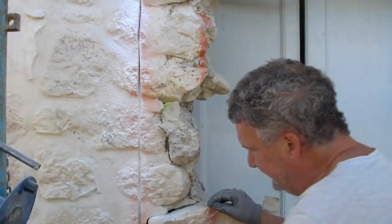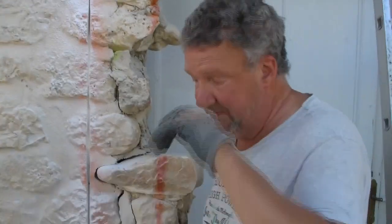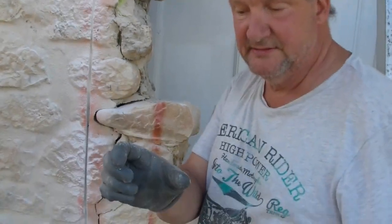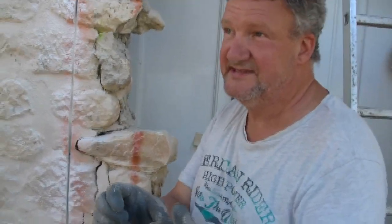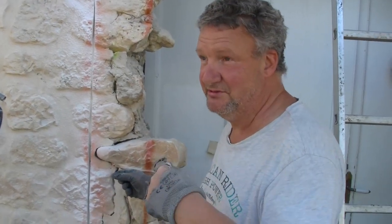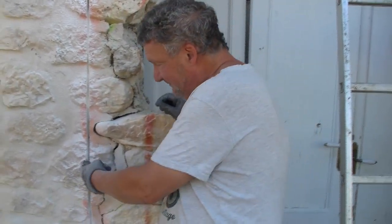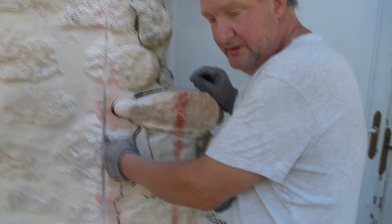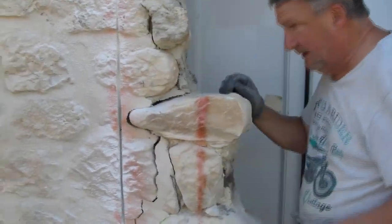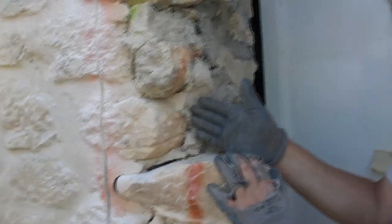And we'll start removing not too much of that stone. Obviously the thickness of the stone that is going to sit in there is 3 inches, so it's about 75 mil less 15 mil, because that's the bit that's protruding. You'll get where I'm coming from when I start showing you, so stick with me on this one. 60 mil. So I need to be 60 mil deep into this wall with that grinder. Right, then I have to go this way. But I'm not going this way with a grinder.